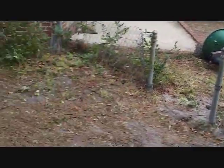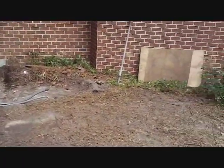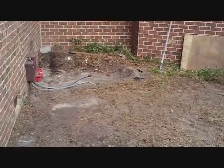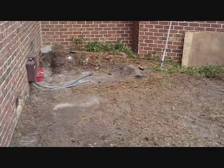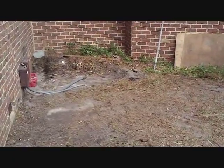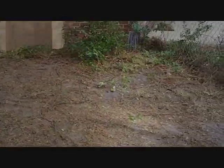Day two out here, and we've got a little bit less fence and a little bit less debris in the way. We're going to get that new ductwork in there down in the crawl space, and I'm going to show you how I put in some return panning. This is the area we're going to pan up in there — you can see the return plenum and some of the boards that go around the panned area.